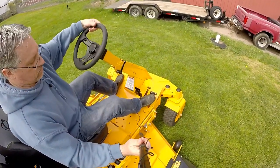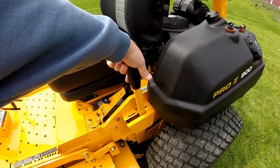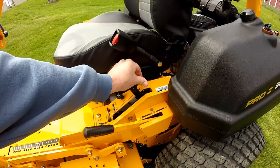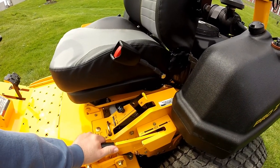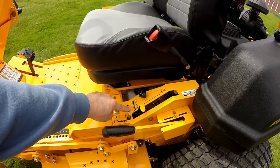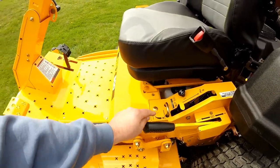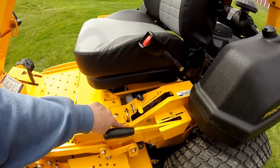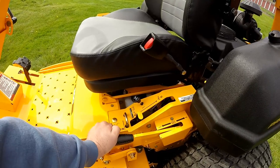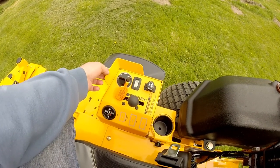On the left-hand side of the machine we have your parking brake lever — down is off, up is on. Right next to your park brake is your hydro release lever with the yellow tab. Move it up into the neutral position and you'll be able to move this unit around your driveway or garage without starting the engine. Right in front of the hydro release lever is your deck transport lock — step on the pedal and move this lever into the transport lock position. Right behind this lever is the choke; pull it out to start the engine, and once the engine starts, push it back in.